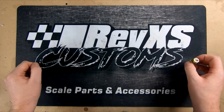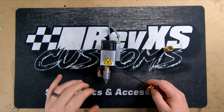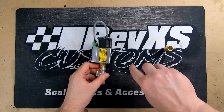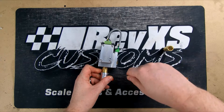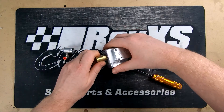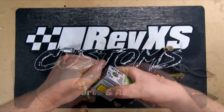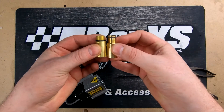Let's get this installed. First you're just going to uninstall whatever you've got, whether it's a stock end or not. This has got our air assist on it, so unscrew the grub screws for the nozzle itself — that'll slide off. Unscrew this; it's fairly loose because it's set to a certain distance from the body itself. We've got the old one off — comparing the two, you can see it's actually a little bit shorter.